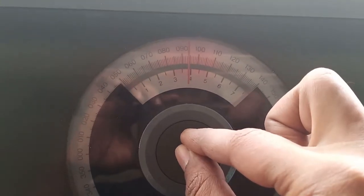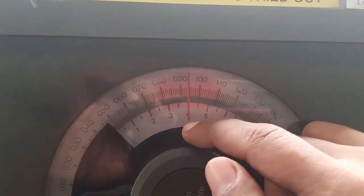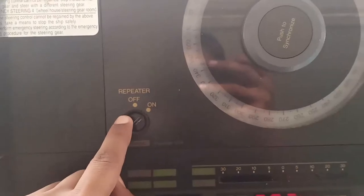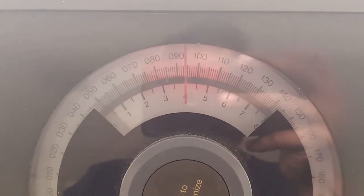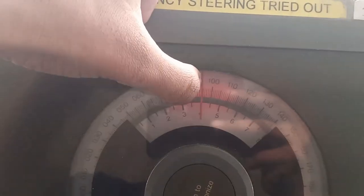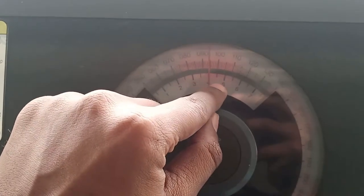Make sure you press and release correctly. As you can see, the reading is now 94. The outer ring gives a good idea: you can see the main reading 90 and the sub-reading 94, since inside it is very hard to distinguish 1, 2, 3, 4. Use your nail to turn it back on — the repeater is now synchronized. The reading inside is 94, not 95. That was just parallax eye error; reading from directly in front, it is exactly 94, matching the inner circle.